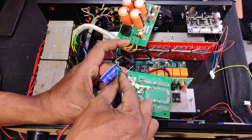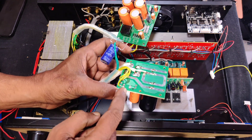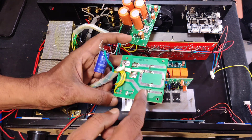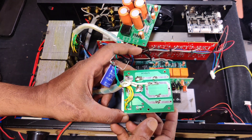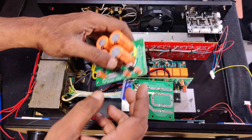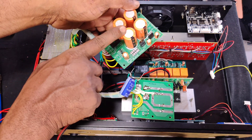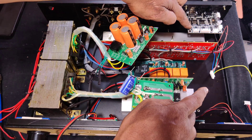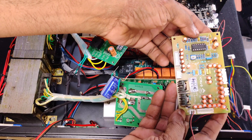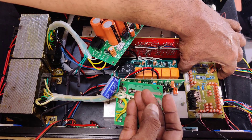Here's the 12 volt connection for the fan and other accessories. Here is another 12 volt for the pre-stages, and this is a ±27V dual supply for the subwoofer amplifier. You can see the ±27V dual supply made using four capacitors and a bridge rectifier. There is another 12 volt coming out for the HDMI Futech decoder, and another board — the control circuit — which will be placed here.